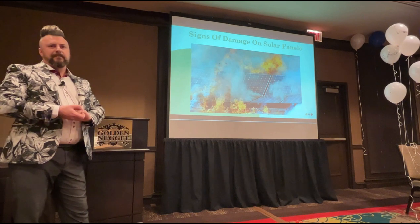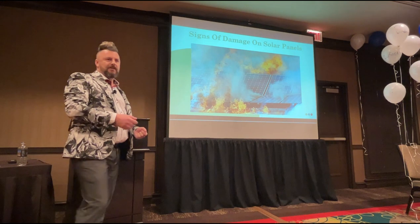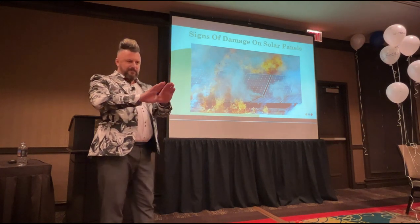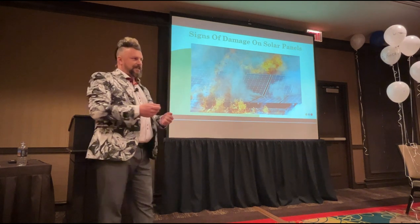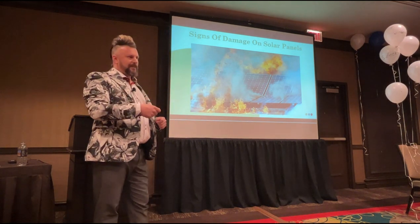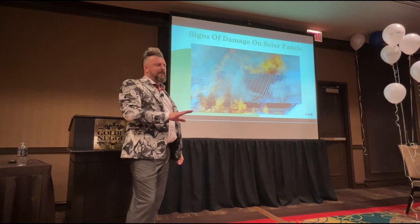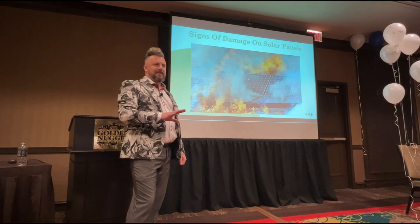Okay? There's a fire extinguisher that's rated for this. There's a product, if anybody wants to research it, called PV Stop. PV Stop is a fire extinguisher. It's black. And inside that canister is a substance that you can spray onto a solar panel safely, and it forms a skin over the top of the solar panel, which you can then peel off. It's heat resistant as well. So in theory, you can spray PV Stop onto these solar panels. You can make sure the system is dead, not producing any voltage. Then you can start spraying water around. That's the theory. But is the fire service going to go to all of that effort? No. Are they going to have PV Stop in their trucks? No.